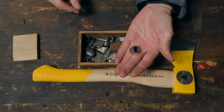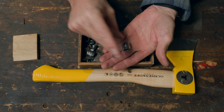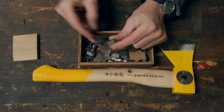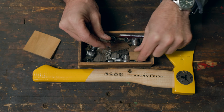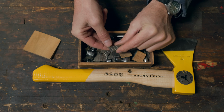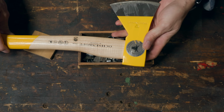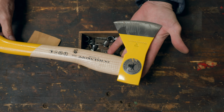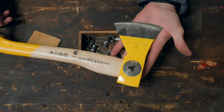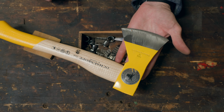And I think that this is a far superior way to the old, kind of the American style of just the metal wedge. And the reason being is, well, I was thinking when you put your wood wedge in and you cross hatch it at a 45 or so with one of these, the idea is to just really press that wood out. And that's been man's great enigma over the millennia: how to secure a metal head to a wood handle, whether that be a tool of war or a garden implement. It's always been a problem keeping it tight, because that's dangerous.